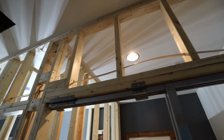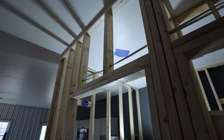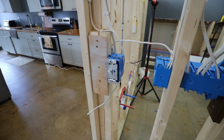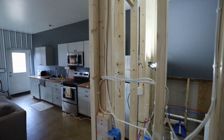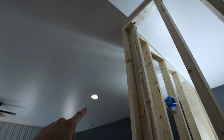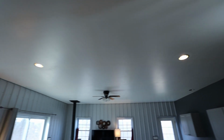And then as for the rest of the lights that were connected to that one, this one I totally got rid of because that was in the bathroom now, and it is not where I wanted a light. I wanted a light on the wall, not on the ceiling there. So I removed that one. And then the remaining 3 here, I was able to wire to this new switch, which is also a dimmer switch. So those 3 were already connected. So all I had to do was run this wire up and through the top plate, and then basically I ran it out the floor joist and then back in right to that one. That one was pretty close to the end of the subfloor upstairs, so it was pretty easy to get to. And I also replaced that light that was there with a recessed light that matches the others.